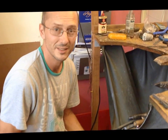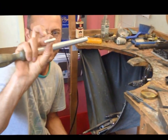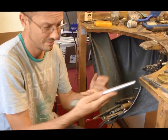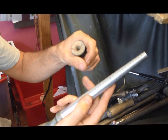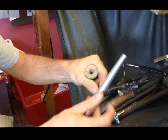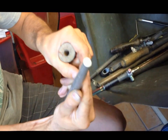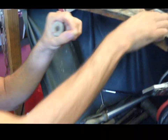The next stage is to work out how long we need that bit of silver. It's not long enough to go around the finger yet, and we've got to make it the right width. We'll assume that you're a size Q. Here's the ring stick — size Q. I'm going to bend some steel wire around there and add on about 3 millimeters, because the silver we're going to roll out will be thicker, so when we bend it around it won't go as far.